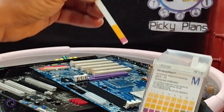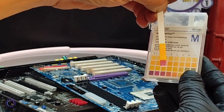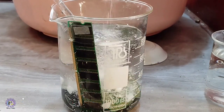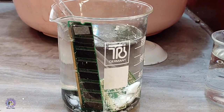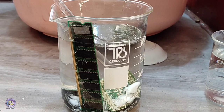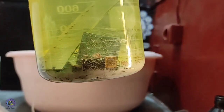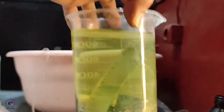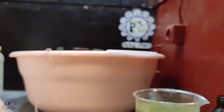The solution pH was around 1, which seems acidic enough to dissolve thin metal. I made a smaller scale of this solution to test. CPU, RAM, and BGA chips were separated from the boards. The small scale seemed to work pretty well and the majority of parts were detached and fallen to the bottom, but we still have to deal with metastannic acid, which is pretty nasty and formed even in this batch.